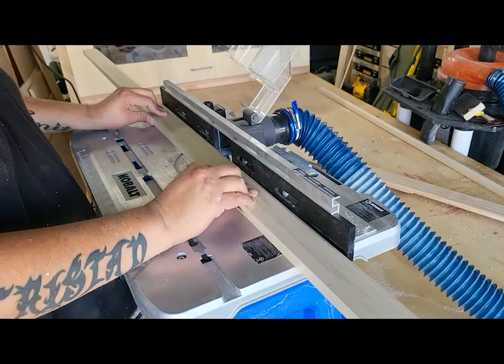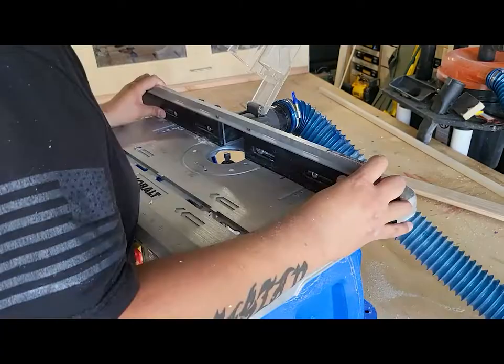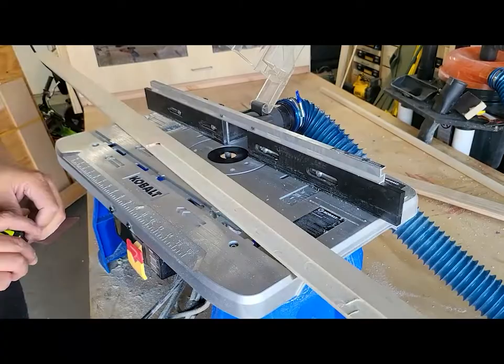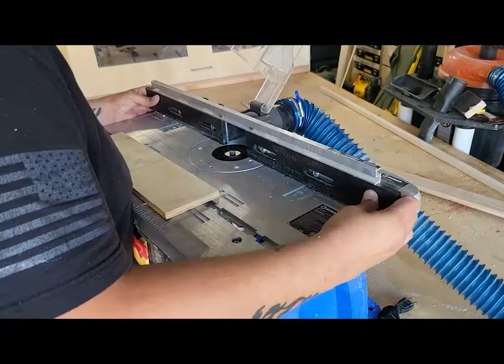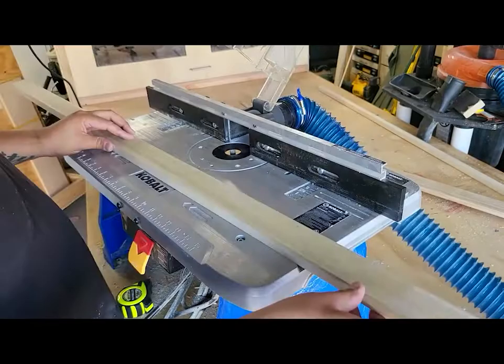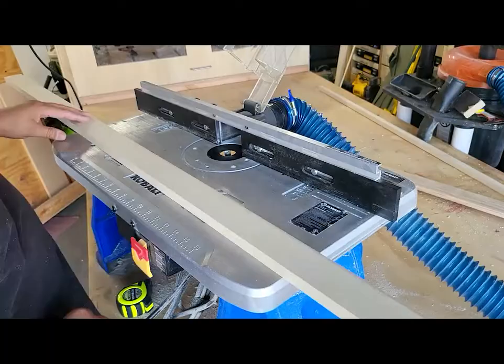Next I carefully measured out the steps of my relief cuts on the trim pieces, starting with about half an inch of depth from the bottom and incrementally getting less and less deep as I worked up toward the middle where the drywall evened out with the door jamb. On the first piece I started routing at the highest point with the shallowest cut all the way to the bottom, then adjusted the bit to cut the next deeper depth and routed down from that point — on and on until I did the deepest cut at the bottom where the drywall was the most proud.